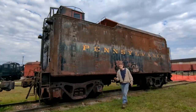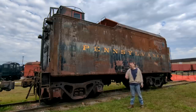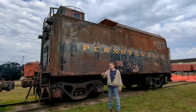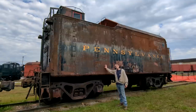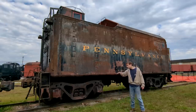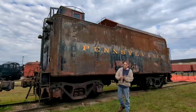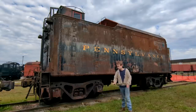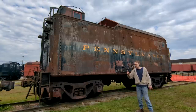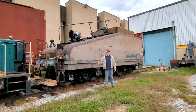In addition to the H10, we're also working on sandblasting and painting the L1 number 520, one of my first favorites. When we restore the tenders, we actually have to sandblast and paint the inside as well, because any rust anywhere is going to continue to deteriorate and eat the metal away. On the inside of these tenders they held coal and water. This water tank needs a lot of work — we need to get all the rust out so we can sandblast and paint it. What we do is called abatement — we freeze it in its current condition so we don't make it any worse.